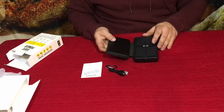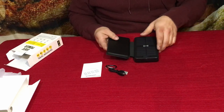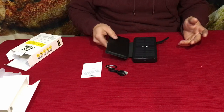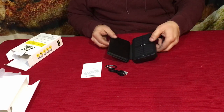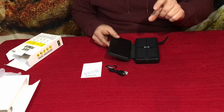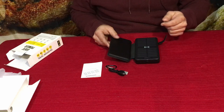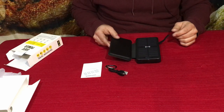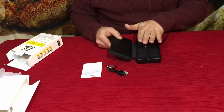I do have some other battery banks — some do pretty well but a good handful are older. Some are very thin — a single flat-pack battery — and even though they claim a high amperage I don't think they really deliver it, because you need that thickness and mass to get your amperage. Just like comparing a triple-A to a D-cell: same 1.5 volts, but a triple-A is about 900 milliamps while a D-cell is around 5,000 — a big difference.